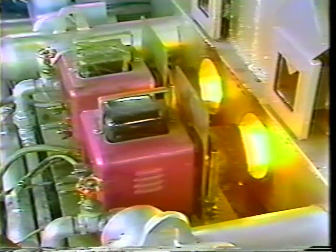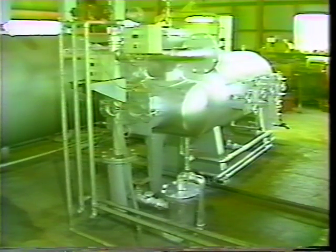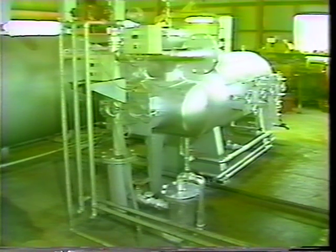This harmless remaining solid formation can also be burned as solid fuel. After the treated waste has been gasified, it is cooled and liquefied. The flammable gases which cannot be liquefied are burned completely in the combustion chamber. There is no smoke in this process, so a high smokestack is not necessary.